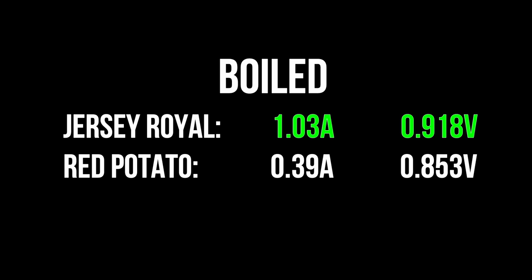So what have we learnt from this first episode of Pocket Science? Well, I've certainly learnt quite a lot about potato batteries. For starters, it does seem that yes, boiling potatoes has a very striking effect on the amperage — the amount of current you can draw from the potato — which makes sense because boiling breaks down the compounds inside, so you'd expect it to be easier for the electrolyte to transfer across. The other thing is that the surface area of the anode and cathode within the potato also affects voltage and amperage, which I probably should have controlled for. To answer the key question — which potato is the best? Out of this grand selection of two, Jersey Royal potatoes have won by quite a way. They are battery-sized and outperformed the red potatoes on both voltage and amperage. So much for Tesco Finest.